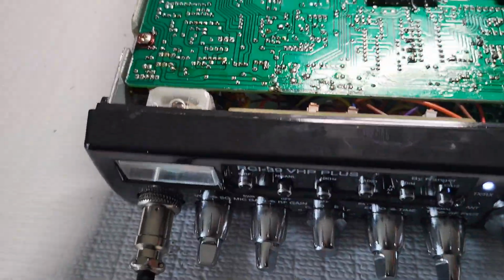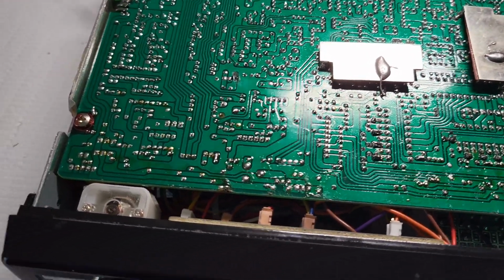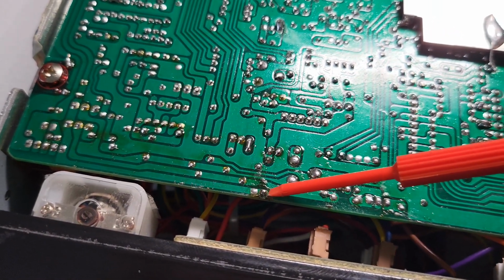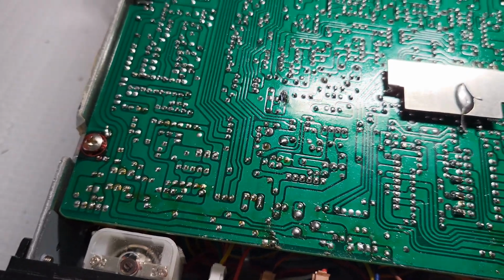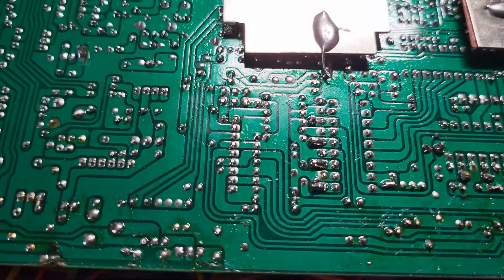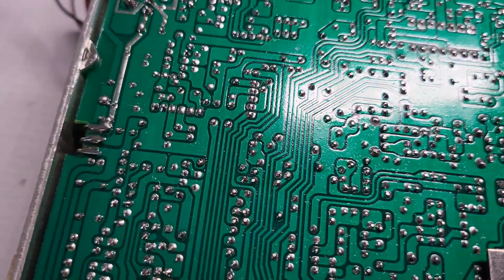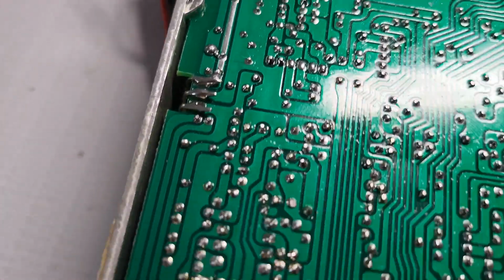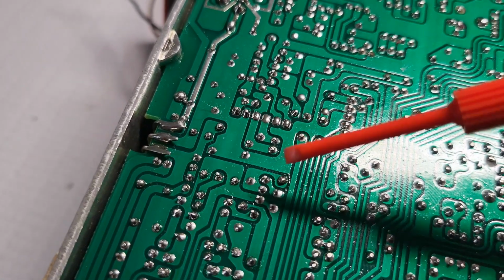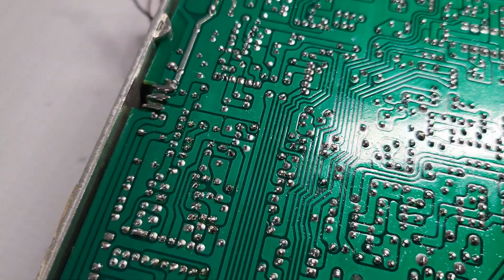But there's some pretty sketchy soldering done here. I feel like it's burnt already. The trace is half burnt there. There's some pretty big globs of solder in some places. That's just not necessary, and then when you look at other spots, it barely has solder. I feel like it's just inconsistent. You either have too much or too little.